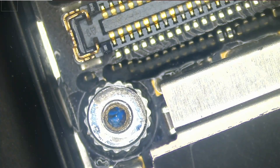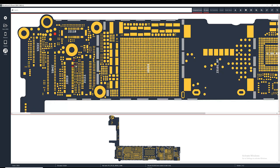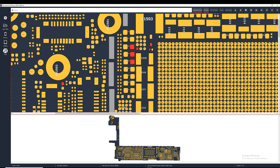Let's take a look at the board diagram. This is the filter that we just tested and the filter is continuous to this pin here. But there is a short. The short could be from this side of the filter, which is this capacitor here, because we have one capacitor here and one end of the capacitor connects to ground. There is a possibility that this capacitor could be shorted in the circuit, or the problem could be from this side — we have three capacitors here.